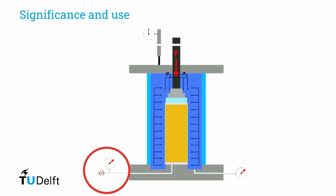If the test specimens are 100% saturated, consolidation cannot occur when the confining pressure is applied, nor during the shear portion of the test, since drainage is not permitted. Therefore, if several specimens of the same material are tested, and if they are all at approximately the same water content and void ratio when they are tested, they will have approximately the same undrained shear strength. The Mohr failure envelope will usually be a horizontal straight line over the entire range of confining stresses applied to the specimens, if the specimens are fully saturated.